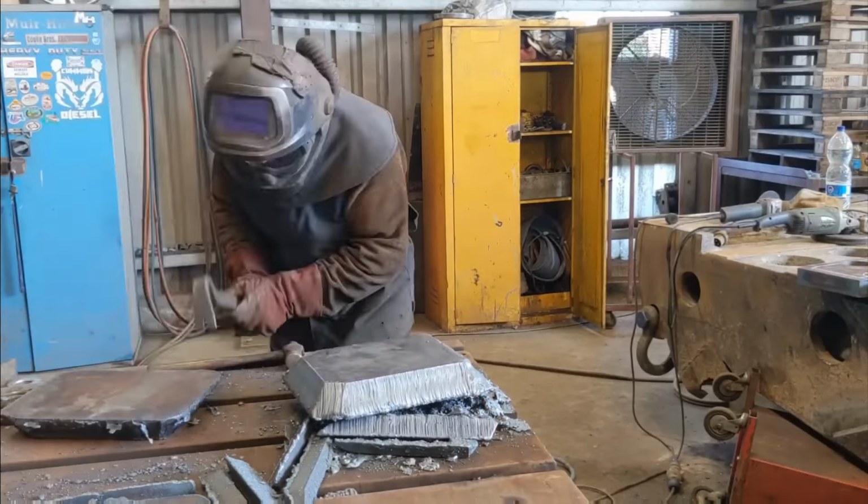The roller fits over the gear. These little replaceable axle pins also wear. That one's not too bad. However, this little brass bush is completely done. So get a new one of those. You can buy little brass bush replacements to refurbish those. We'll go and get a new one. I noticed this was going because my wire stopped feeding smoothly. This seems to be the cause.